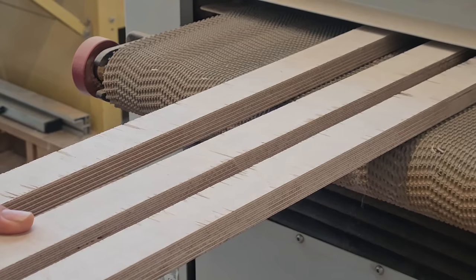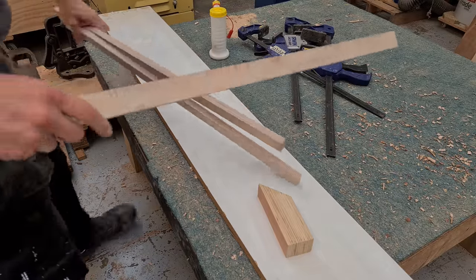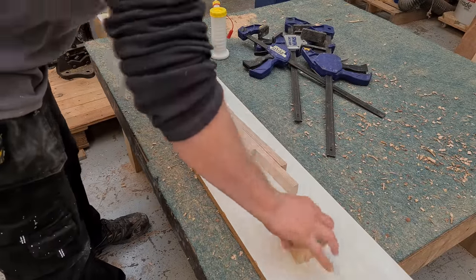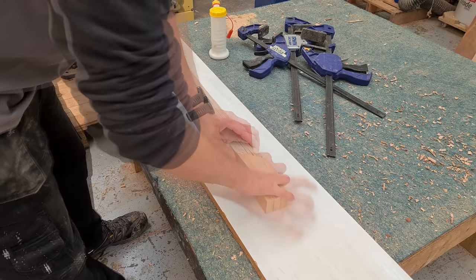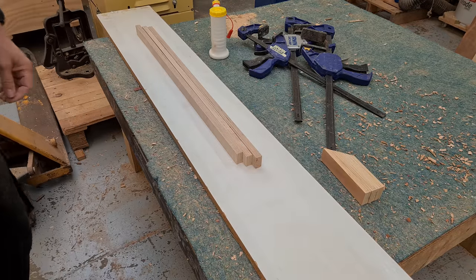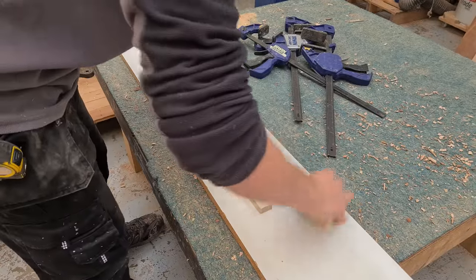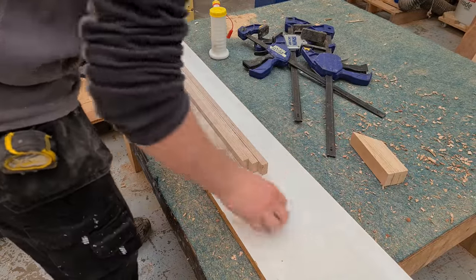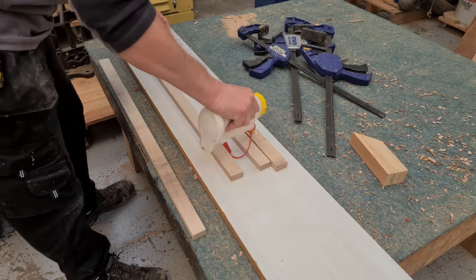The first task was to cut the sheet into strips, remove the paint from the upper and lower surface, and then drum sand to ensure I got the same height of material and the same number of ply. Three strips were glued together and then offset at 45 degrees to try and maximise the amount of material being used. I did a lot of calculations trying to figure out the best possible way to make segments of patterned plywood.